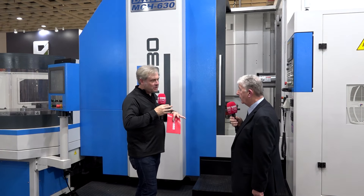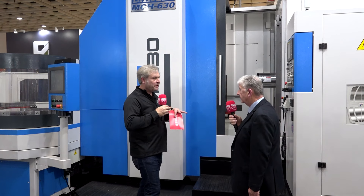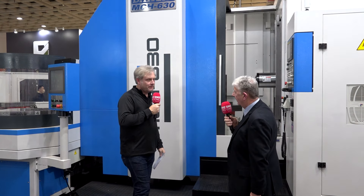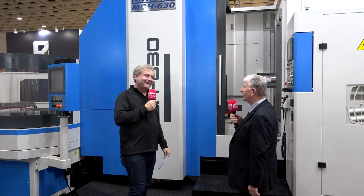With setting the machine, because you've got the fourth axis, that should actually help. We can offer either one degree or a full fourth axis with a minimum increment of 0.001 of a degree. Where that comes in — a lot of people don't think of this — is speed of setting the machine up. If the fixture is a simple job for one component, you can square it up by rotating the B-axis, set a workpiece datum, you don't need an expensive fixture. And if the customer has that occasional crash, you can recover within seconds.